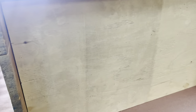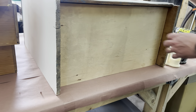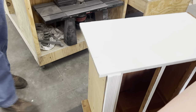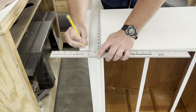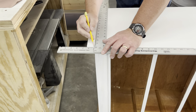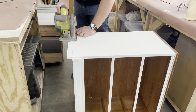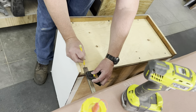The bottom of this piece just seemed unfinished, so Chris is attaching a piece of plywood to the bottom so that it is closed, and we're going to put some legs on it to make it a little bit taller — that'll give him something to attach the legs to. On the sides, we've got these pieces that kind of just hang out there and he's going to cut those off flush. I had some crackage that I needed to fill in, so I stopped painting — when you paint something white, the crack just shows up. So this was the perfect opportunity for him to get those sides cut off and get the feet added on.